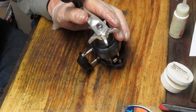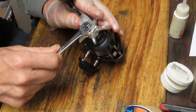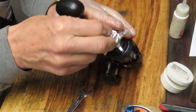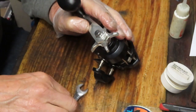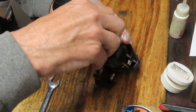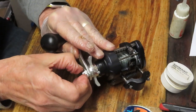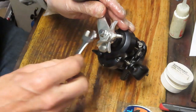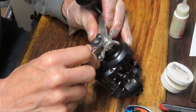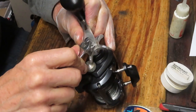Oops, wrong wrench. Tighten your cap washer. This has a point on it. Several points on it, but generally if the point can go to that opening for your little tie-down screw, your adjuster generally will make that. I missed. So next best thing, leave it on. Just take your wrench and just complete it a little bit more. Keep turning it until you have a visual sighting of the screw hole. Don't over tighten the nut. Back it off if anything, but we've got room here.